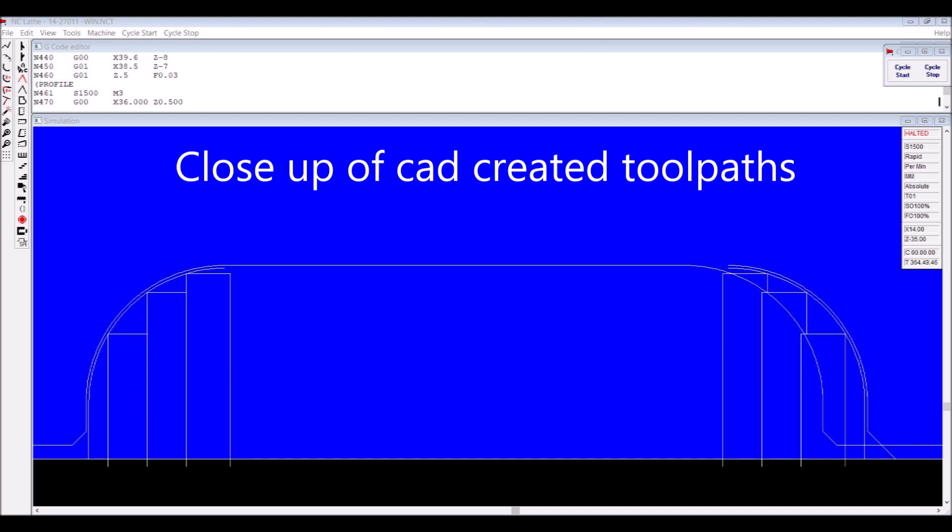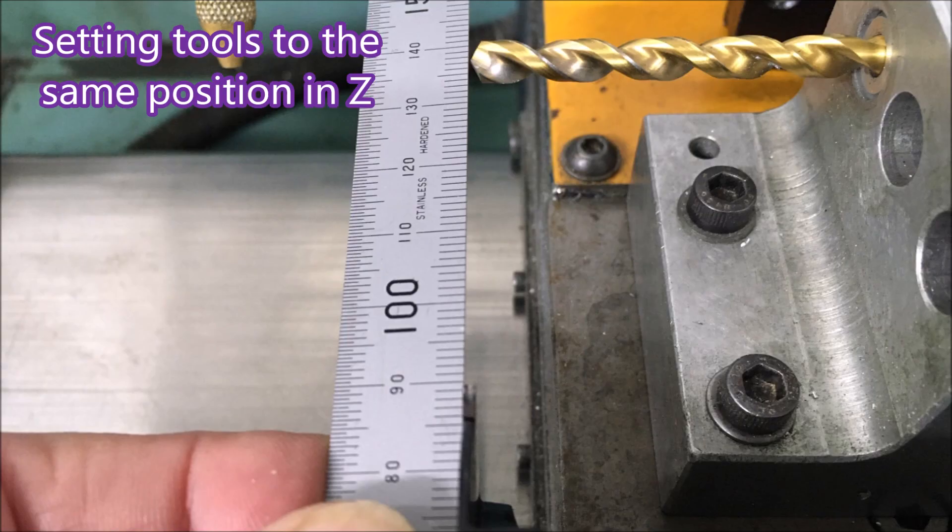There you can see a blown-up version of it. Each of those shapes has a corner touching a 4.9 millimeter radius, which I've drawn inside the 5 millimeter radius that will actually be the path the tool follows. That gives me some roughing and then some finishing. That's just setting the tools so they're both at the same Z position — that way they either both miss the chuck or they both hit it.